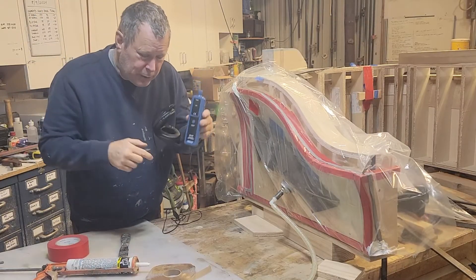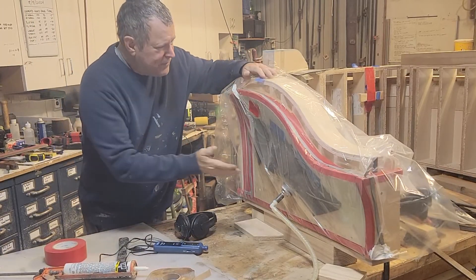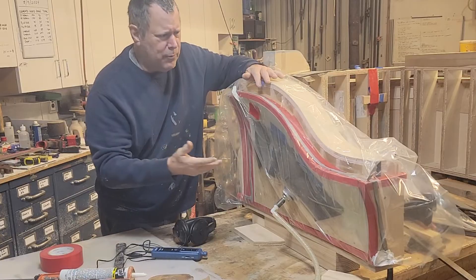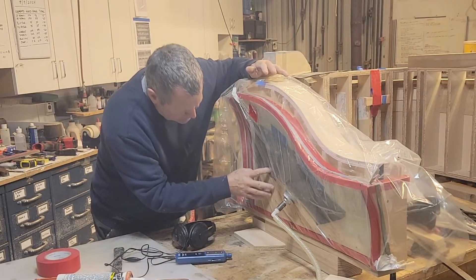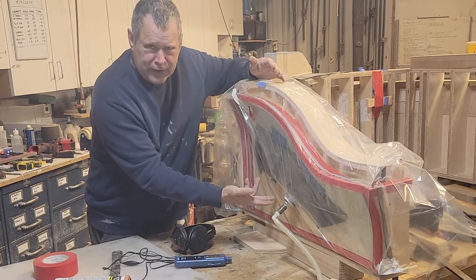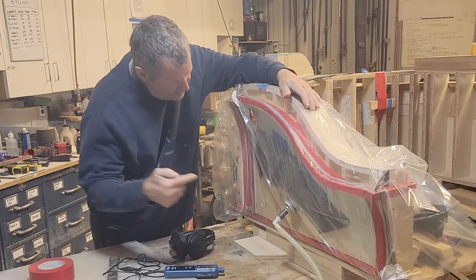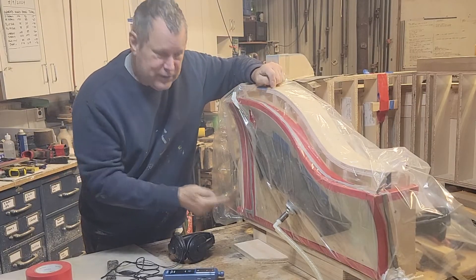I'll put up a link down below. As a side note, what was very interesting: I kind of anticipated it but still had to work some bugs out. This is bendy ply on the inside here, and I was checking for leaks all around but I was still only pulling about 10 inches of vacuum. I knew there was a leak somewhere and couldn't find it. Then I held the detector right in the middle and it went off — I was looking for pinholes in the bag and they weren't there. There was one here that I found, but I couldn't find this other one, and then suddenly realized the detector can detect the leak through the bag, meaning the leak is on the other side. The leak was these staple holes that had been stapled but missed a rib on the other side — so I actually have a hole through the surface.